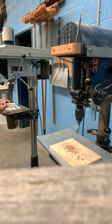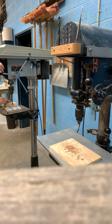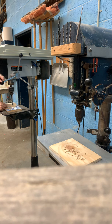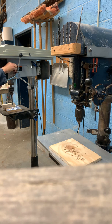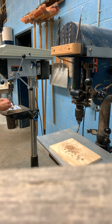If on my project I only want the hole to go partly into the project, I set it behind the drill bit and drop this down so that the flat part of the bit is even with my line. Then I loosen this little toggle, spin this around until the zero and arrow are lined up. Check to make sure I have my zero and arrow, then snug this little toggle. Now it stops at that point. So I'm going to go back up — let's say this is my center point, I've measured over and made my line, measured up and made my line. I don't need to worry about what it looks like underneath because I'm not going all the way through, but I should have a nice clean piece of wood under it so it sits flat.